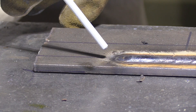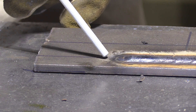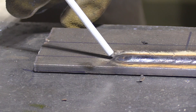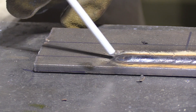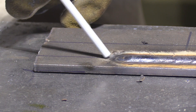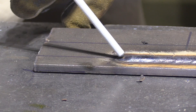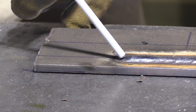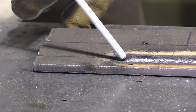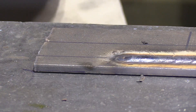For your restart, strike off about a half inch ahead. Once you strike off, you don't want to slowly drag it back — you'll be leaving all kinds of unburned rod, slag, and porosity. Strike, come back to the crater, but don't bring the rod all the way to the end of the crater. Stop just about the middle, swish the puddle around to the back of the crater with a little side-to-side motion, and then take off. That'll give you a nice even restart.